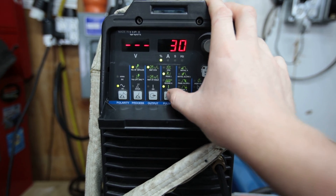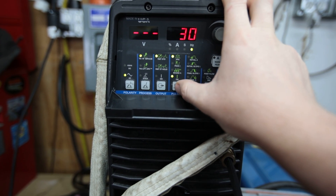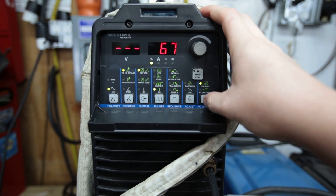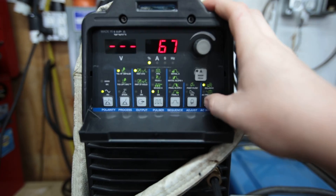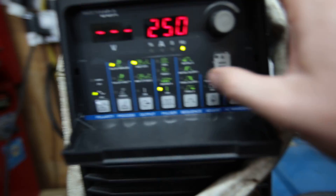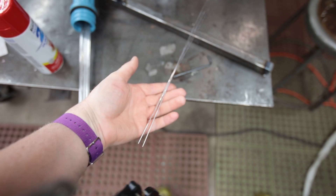My manual doesn't match the firmware version on this welder, so some settings don't line up, but I'm pretty thrilled with it. Right now I'm running 30 pulses a second, 30 percent for my peak, 35 percent for the background, balance at 67, AC frequency at 250 Hz, and my amperage set at 30 — just working it with the foot pedal.